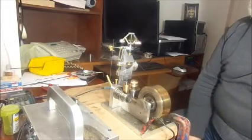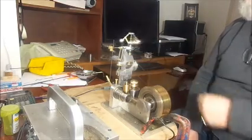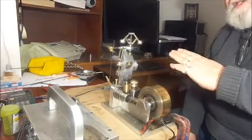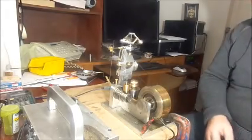It'll have to warm up there for a minute. But you can see what's happening over here. Once the engine started and the flyballs flew out, that cut the speed back. This is the governed speed right now that we're aiming for.